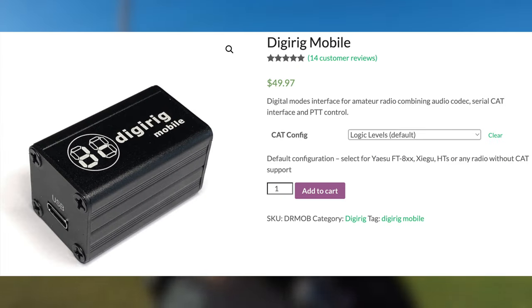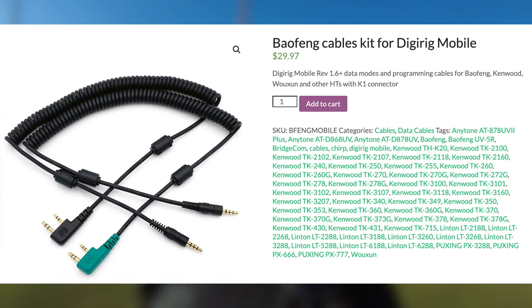Now, while my setup is very convenient and easy to run, if you can't make a connection to your Winlink packet station, then it could be difficult. Well, we walked to the next location to try to get away from what could be interference. I'll mention the other way that you can connect, which is Vara FM. You can do Vara FM with a simple Baofeng and a wired connection to your PC using something like a DigiLink. We talked about this a couple of months ago. Actually did some Vara FM. And you could totally run that with your $60 laptop and it'll work just fine.